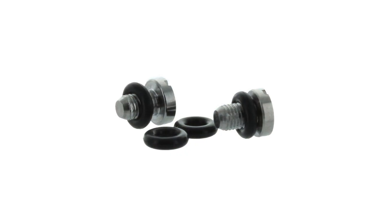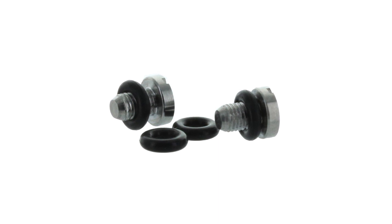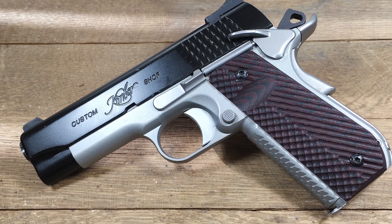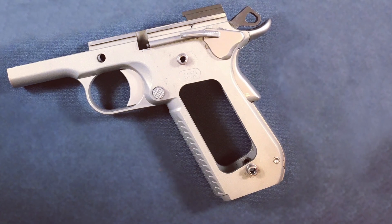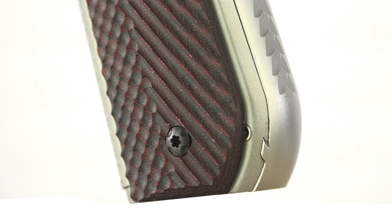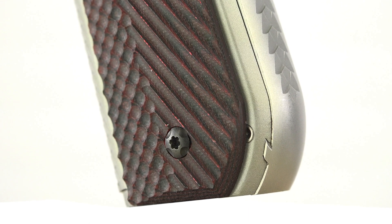As well, you might need to use O-rings to improve the fit between a standard size grip screw and that slim grip. Having assembled all the components, I ran into one more consideration: my gun — which was not originally my gun, it was a Gun Rider gun — actually had oversized grip bushings. This can happen because, on 1911s especially, if those grip panels start to wobble free or the bushings start to get stripped, gunsmiths or manufacturers will replace the original bushings with larger ones, basically drilling a larger hole and putting in a larger bushing. So what I needed was not just thin or slim bushings — I needed oversized slim bushings.